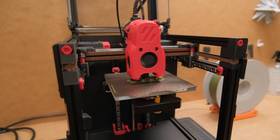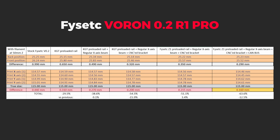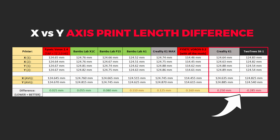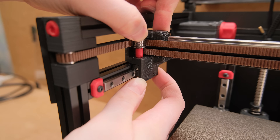So was all this worth it? Oh yes. The slim and more flexible CANBUS cable reduced the print length difference by another 14%, and by more than 60% in total. Now we are reaching levels that are acceptable and even better than some consumer-grade printers — but they are still not perfect. Things like how well you build it and changing those loose Y-axis rails most likely make the final difference.